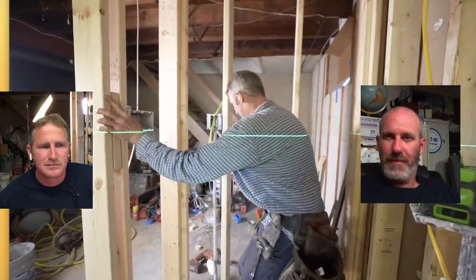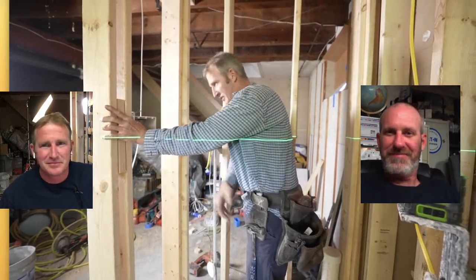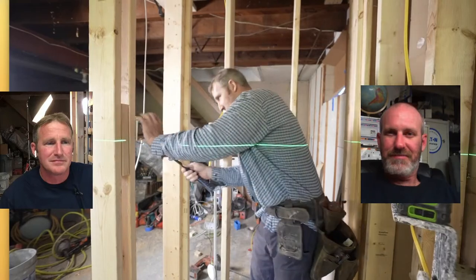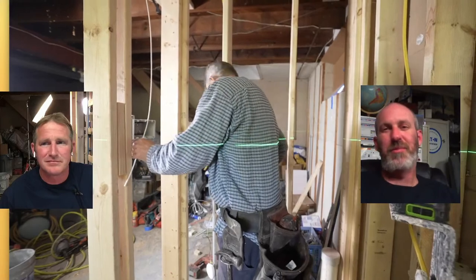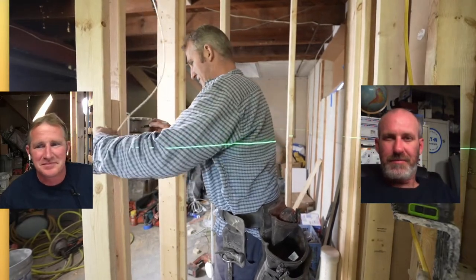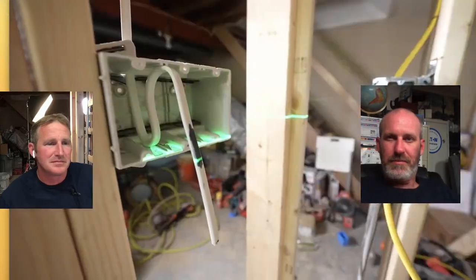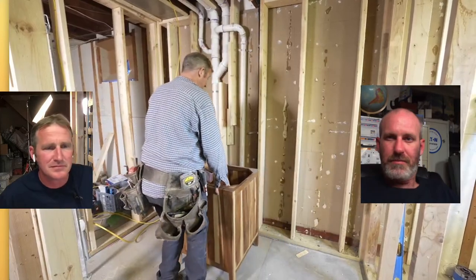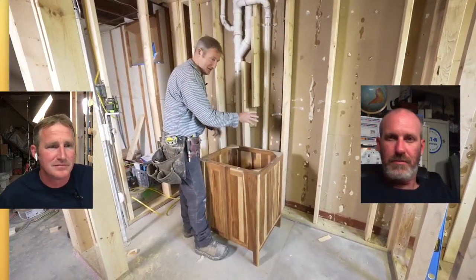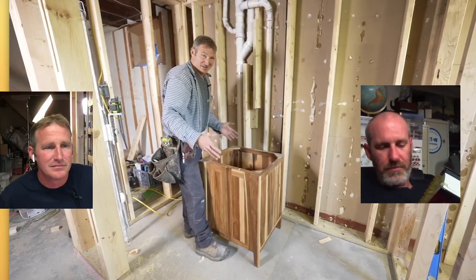We'll line this up with our laser and make sure these tabs are sticking outside of the finished wall since we'll have half-inch drywall. I indicate my power supply in all black so that when I'm configuring things I know what is what. For the vanity outlet — this is a tight space and we're doing a unique faucet with a marble backsplash, so I don't want the outlet where it's going to interfere with the faucet.